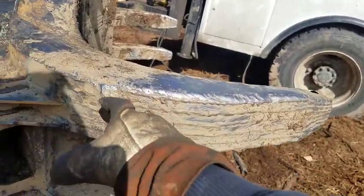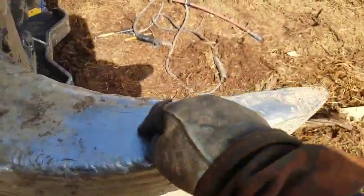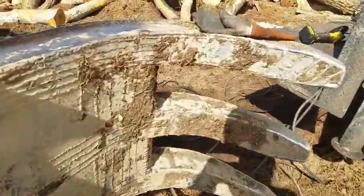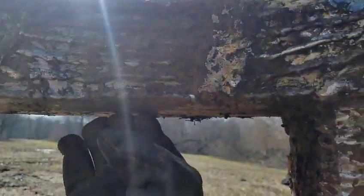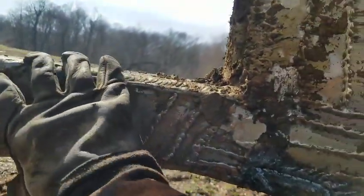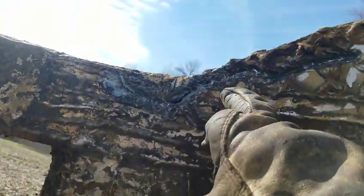Taylor, of course, welded it back on and we gimped through for a while until we got down at the mill. But Taylor took some half-inch plate, cut it out, and laid it down inside there and welded that sucker in. This is what it used to look like — it used to be just a channel in there and it wasn't strong enough on the two-finger side because it got so much pressure on them. So we welded the plate in there, one here and one down here. We think we've got that solved as far as wanting to tear off. Then it started cracking in here — we filled all that in with weld, and now we're starting to get some pressure out here off of the fingers, and that's becoming an issue.